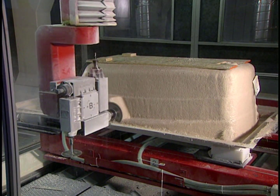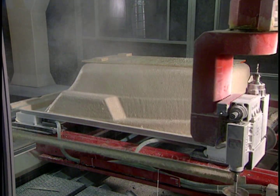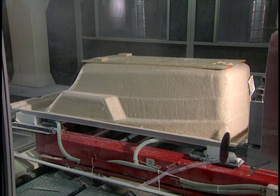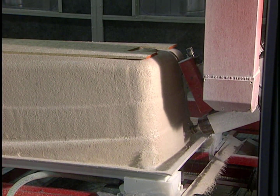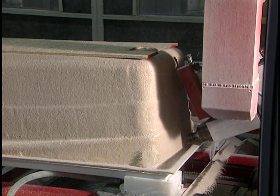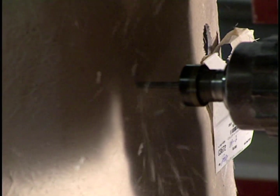The shell is dry and hard. They can extract it manually, but here they use digitally controlled machines. The operation begins with the trimming of the edges of the bathtub. During this process, the robot will pierce openings for the drains, the whirlpool jets, and the air jets, for the overflow and for ambient light.